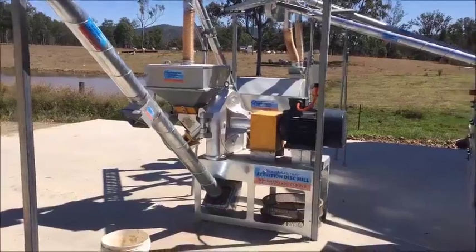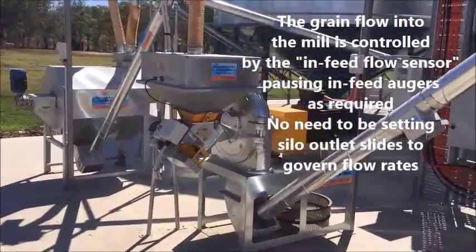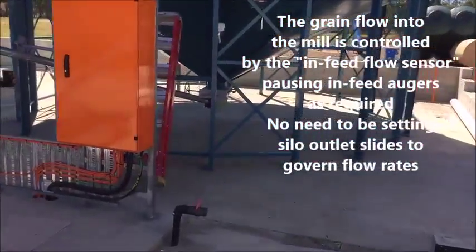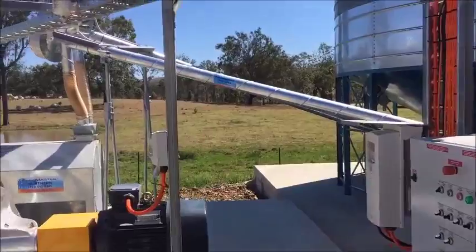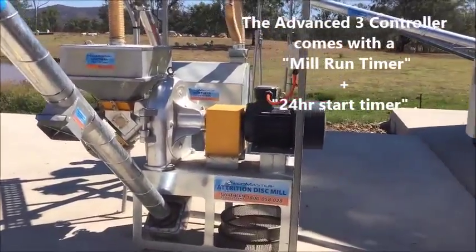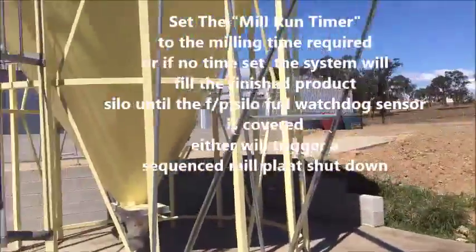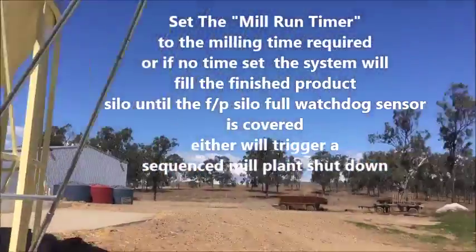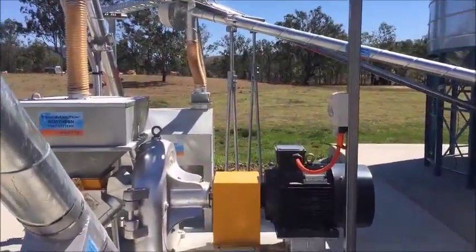The flow is controlled by the sensor in the top of the hopper, so we don't have to govern with the grain flow by the slides on the silos — we can just have those going fully open and allow the system to run. This system will either be run set to a time, or the high level switch in the top of the finished product silo will switch the system off when the silo is full. That does a systematic shutdown so everything is cleared ready for the next start.